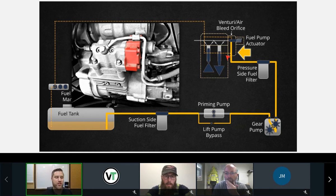Where could contamination possibly come from if I have a 5 micron filter in place? When you change out that actuator housing? Or when you change your fuel filter and you pre-fill it, right? That's more common. That's a regular maintenance item, and that's what's potentially causing failures of our high pressure pump. Pre-filling of that filter, some of those contaminants may enter the actuator housing, restrict some of the passages, resulting in a pumping plunger failure, resulting in a low rail pressure fault code.